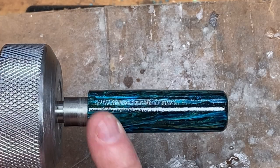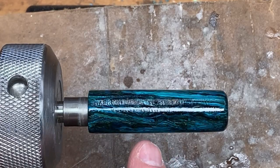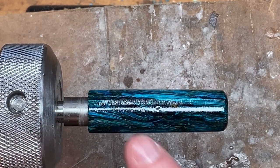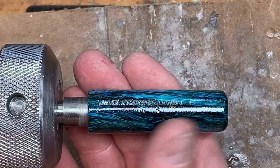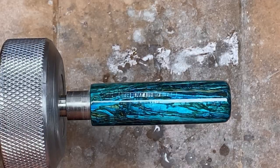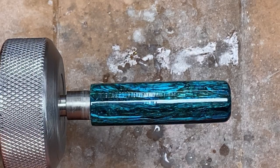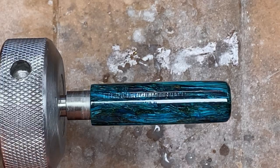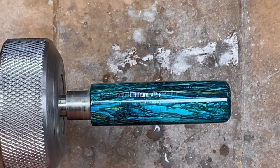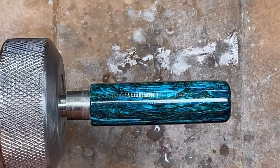I just finished applying five coats of medium CA, and I've got three or four little spots where there are divots. We're going to do what we did with the other blank — I'm going to sand this down, we'll see those disappear, and then we're going to apply four more coats of CA, micro-mesh, and this blank is going to look as good as the body blank. The cap for this pen turned out every bit as amazing as the body — the colors are blowing my mind. I've gone ahead and applied my CA, sanded it all off, got it nice and smooth, made sure there were no divots, reapplied the CA, micro-meshed it, and now all I need to do is apply some wax, buff it up, and put this cap with the body.